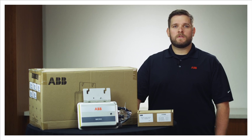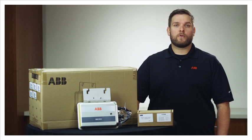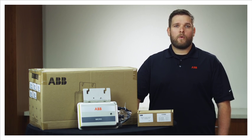Hi, my name is Cameron Stewart. I'm an ABB PV Academy Trainer. Today, we are going to go through the preparation needed to install the ABB Micro and CDD. We will also explain the settings of the correct grid country standard parameters. These steps should be done prior to the ABB Micro hardware installation. This acquisition method is designed to configure and acquire all of the micro inverters for a particular installation before they are installed on the roof.